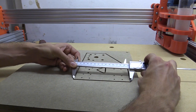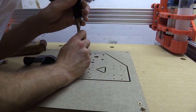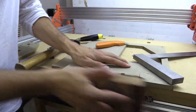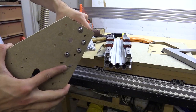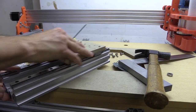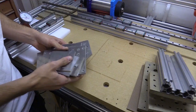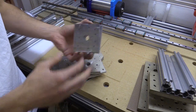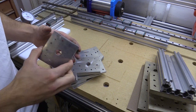Eventually I got some plates waterjet cut in 4mm 6082T aluminium, but to get there I had to do a lot of tests. I made some plates out of 12mm MDF, and I even printed some — both of which were valid methods of prototyping. One I could do during the day while I was in the workshop, and the other I could do into the evening knowing the noise wouldn't inconvenience anyone. I'm going to jump straight to the aluminium plates; unfortunately I don't have any footage of this being cut, as I dropped the material off one morning before work and came back a week later to collect.